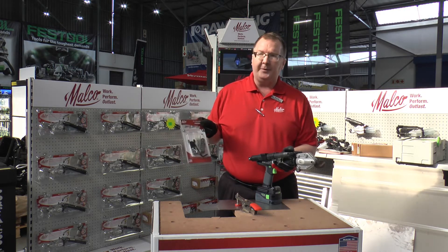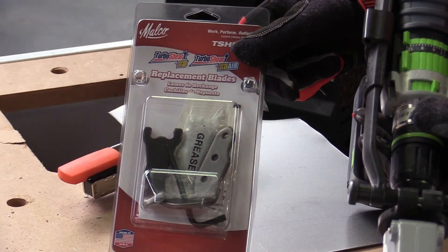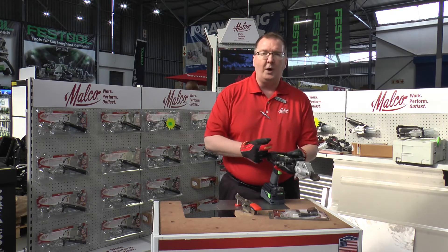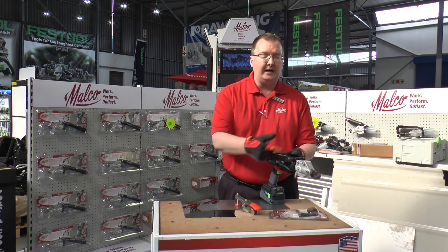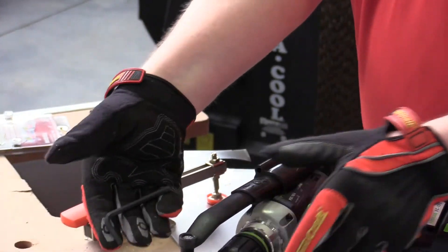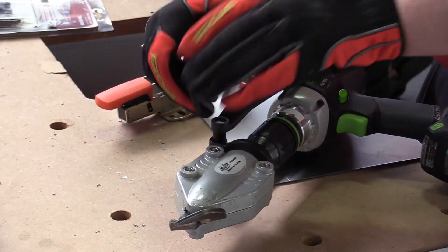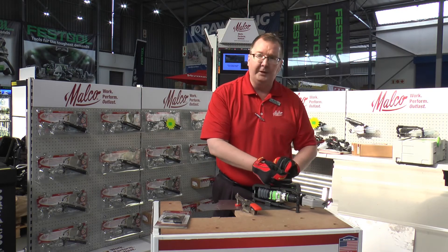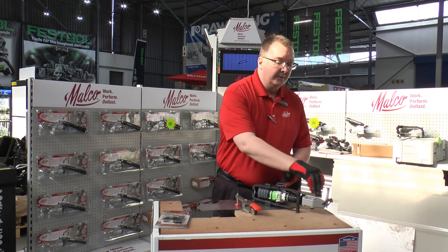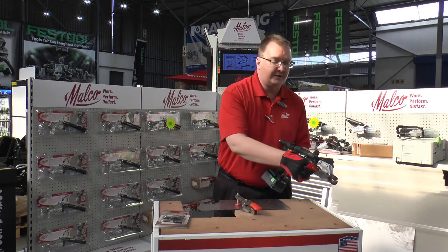When you can no longer make adjustments, you'll want to buy a replacement blade set from Malco Products. Do not try to resharpen the blades on your own — they are a computer-controlled grind and you'll just make a mess of it. Using the blades properly, you'll get about 1.5 kilometers of cutting use before needing to replace them. When it's time, that same hex key is used to take the case apart. Take the old blades out, put the new blades in, use the grease supplied in the kit, button it back up, and reset your adjustment screw back to where it cuts well.